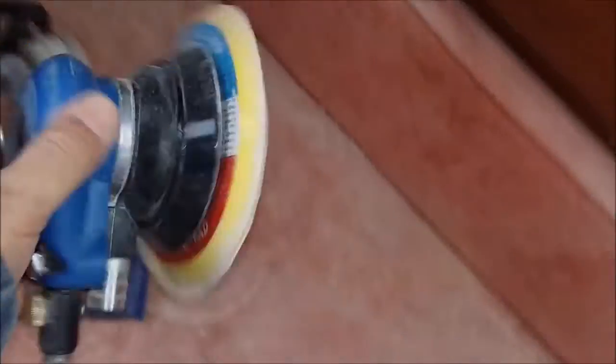Now it's all done, the next job is sanding. The problem with sanding is I need to be careful I don't go through the veneer to the plywood, so it has to be a light sanding. I'm using a 500 grit pad on the air sander.